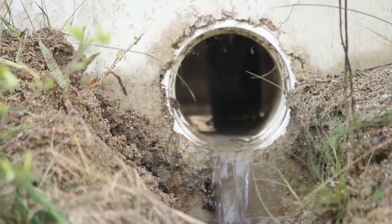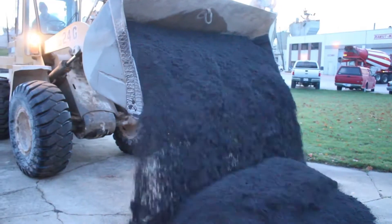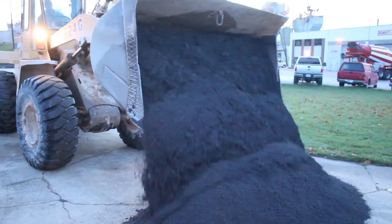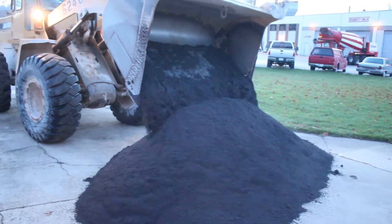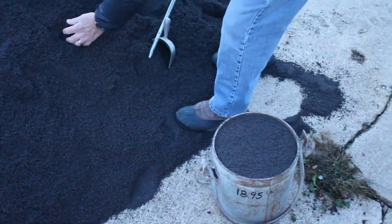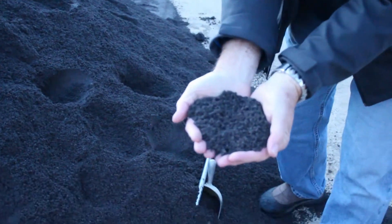While draining, the stockpile may be covered with a non-absorbent material, such as plastic. On this job, we are using a fine lightweight aggregate gradation, a number 4 by 0. An intermediate gradation can also be used effectively. Consult with your local expanded shale, clay, or slate producer for assistance.